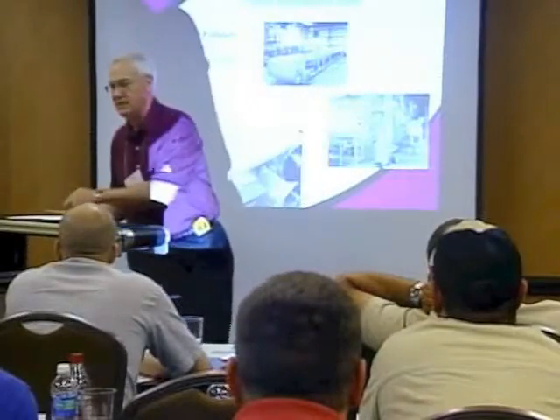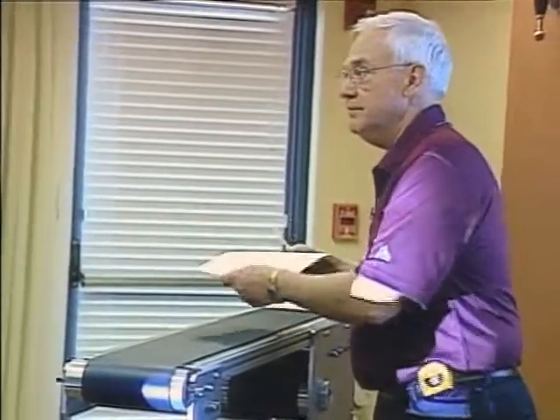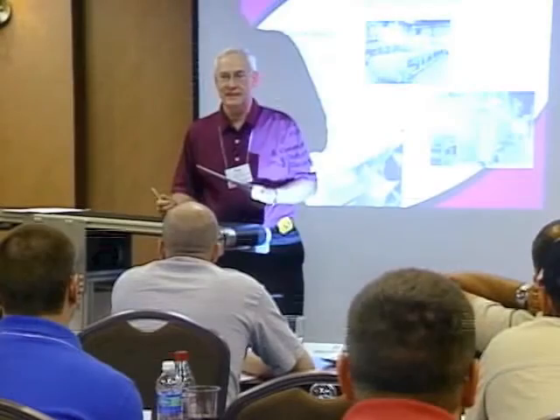The point at which the belt comes in contact with the conveyor pulley first is the direction that belt is going to track. If I put the paper down and slightly move the dowel off dead center by angling it, I'm turning the bicycle — and look what happens to the paper. It starts moving to the right. You can push in the center and cause that belt to track right or left, or if it's perpendicular, it will track square.